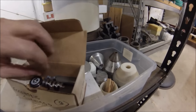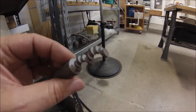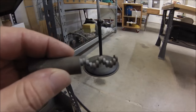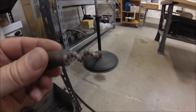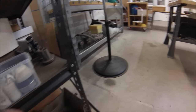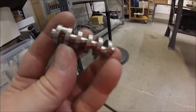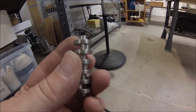I'd like to show you this because we're probably going to get a kick out of it. This is some eccentric turning we've done over the years — that is a solid piece, and it was turned right here on this lathe. That's done in an eccentric collet: the part is indexed as the tool is moved, it's plunged, and you work from the end in — otherwise it would just bounce and boing all over the place. This was actually done with a parting tool.